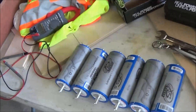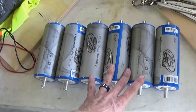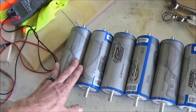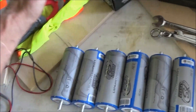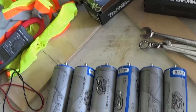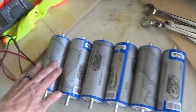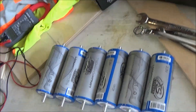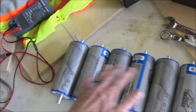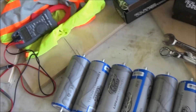With heavy use — if you barely got enough cells to meet your power needs — you're going to have to break your pack down and equalize them often as regular maintenance if you don't run a balancer. Balancers are rather cheap. If you're going to run 6 cells, you need a 6S balancer. If you have 12 cells, you need a 12S balancer. The S stands for cells — that's the type of balancer you need.